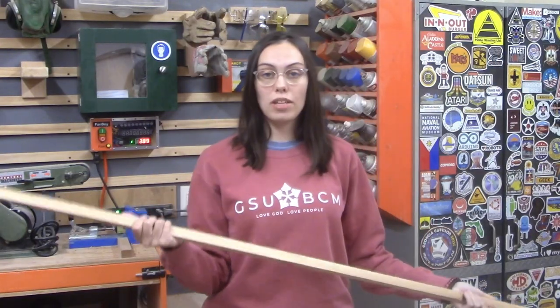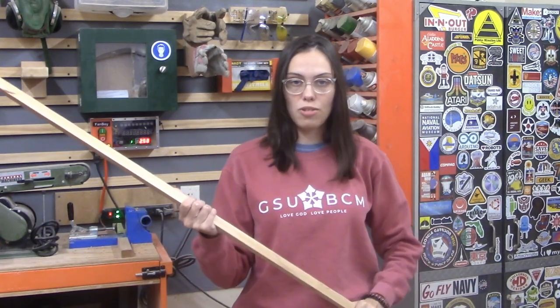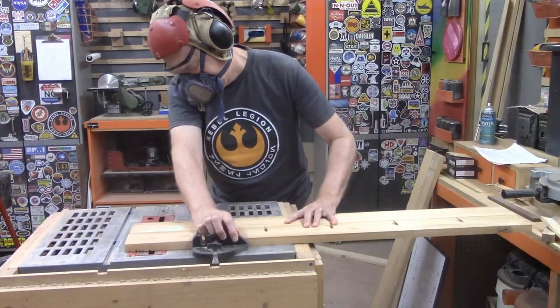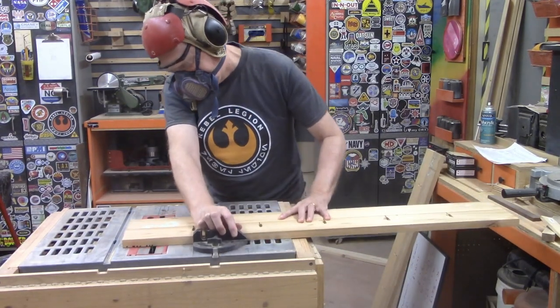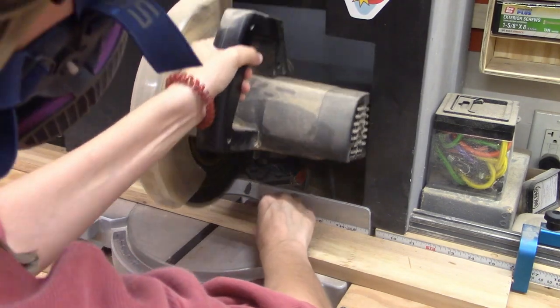Completely expectedly, the pocket holes worked. Now we have boards — they're together. All they need is to be notched. He notches them while I cut the spacers, so the bats have enough space to crawl up and down as you do as a bat. Slotting is pretty simple — there's just a lot of it to do. The spacers are three-quarter inch square strips cut into three-inch lengths.